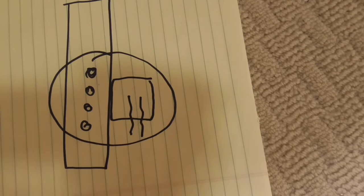Now what they did is they had to route a wire from the junction box across the ceiling, all the way down over to the wall over there. You can see the light switch, I think. There it is. So let me explain what he did. And before I do that, underneath here is where that plate is. The plate is screwed directly into the stud going this way, and then the down pole is put in there, and the whole thing's assembled. The remote is put in there, the wiring for the remote.